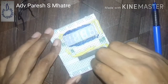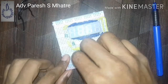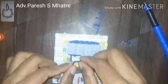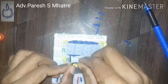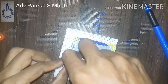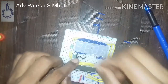Now we are connecting power supply pins — positive and negative — to the microcontroller. We are also connecting push switches to port D pins 7 and 6, and mounting them on the breadboard. The cathode pins of the display are connected to port C pins 5 to 2 respectively. All connections for our breadboard clock have been completed and it is almost ready.